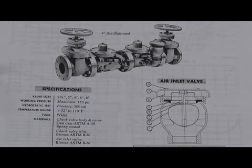Most pressure vacuum breakers are sizes 1/2 through 2 inch, and they tend to be a brass body angle type construction. But for larger sizes, there was some concern or demand for a double check in larger sizes, so an RP didn't have to be installed. So several manufacturers, Clayval being one of them, did produce a 2-check pressure vacuum breaker where they took their standard double check and, by mounting an air inlet on the downside, gave it the ability to operate as a 2-check PVB. Production on this began about 1970 and was discontinued about 1990-ish. The air inlet, as you see right here, was just mounted on the end. It was strictly an air inlet, spring-loaded to have a minimum 1-pound loading like a pressure vacuum breaker.